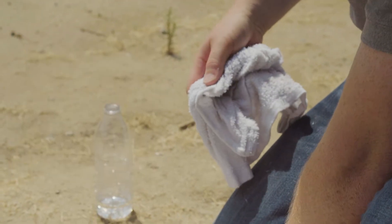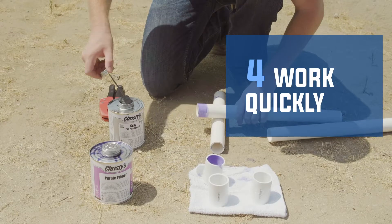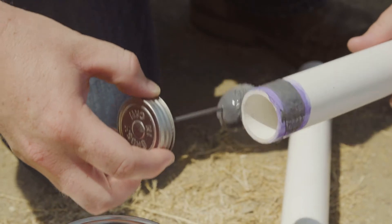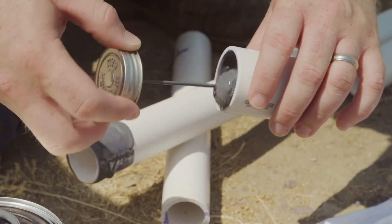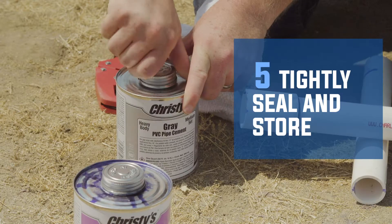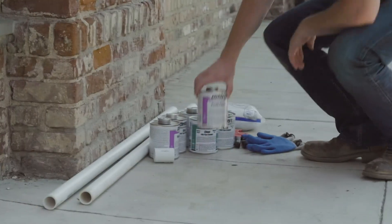Before welding, use damp rags to cool pipe and fittings. During hot weather, have all pipe and fittings on hand so that wet joints can be assembled quickly. Work quickly when making joints to prevent the solvent from beginning to cure before the joint is made. Avoid spreading the cement into too thin of a layer to reduce evaporation during assembly. Tightly seal and store primer and cement in a cool place to avoid evaporation.